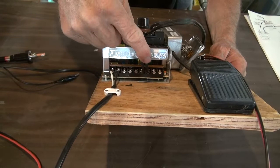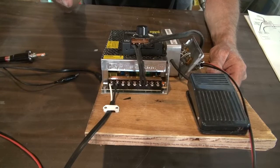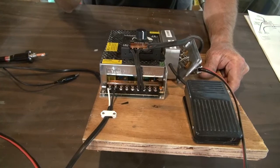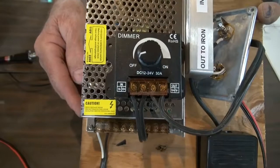Then I did my dimmer switch. The reason I did a dimmer switch is I can regulate the amount of power going to the specific part. So if I've got something that's fairly heavy, I'm going to give it as much juice as I can to heat that specific area and solder it. But when I'm doing a railing or something that's very thin, if you hit it with a lot of power you're just going to melt it. So that way I did this little dimmer switch. Very simple operation — it costs 12 bucks.